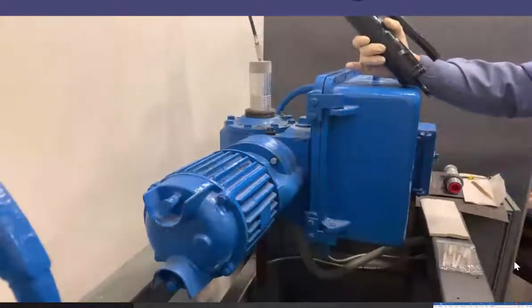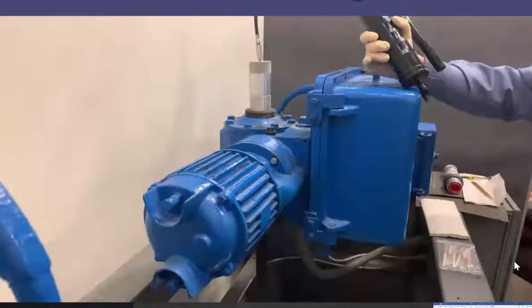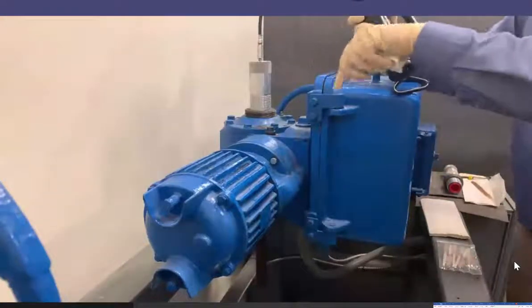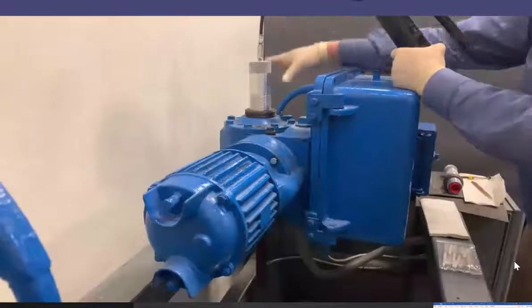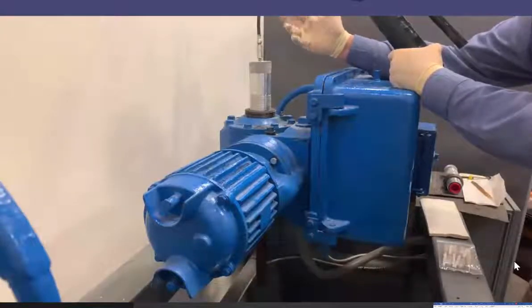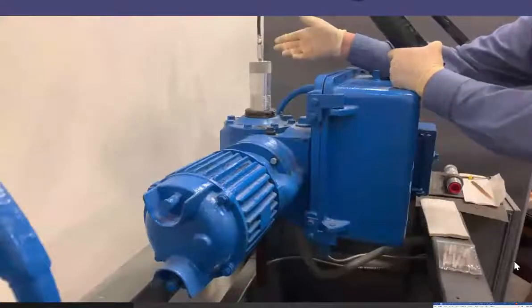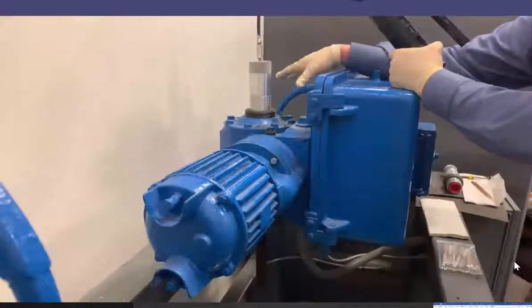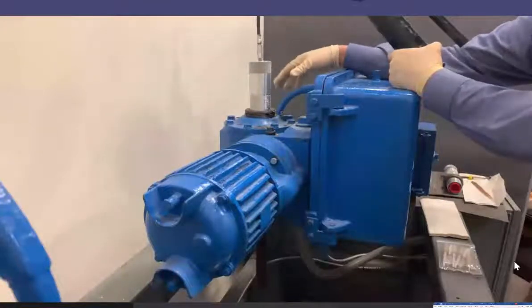That's going to push the old grease out. For development of this tool, we created a clear 3D-printed stem nut — some of you may have seen this at previous MOV user group meetings where I demonstrated it. It actually shows the grease coming down, following the threads, and on the clear nut you can see it pushing the old grease out, purging it through the bottom, and putting a new layer of grease onto the stem and stem nut. It won't clean or strip hardened material, but it will push old grease and debris out and generate a new layer without disassembling the valve.